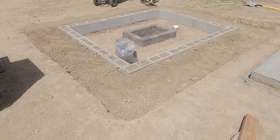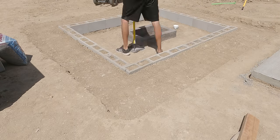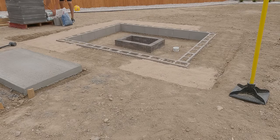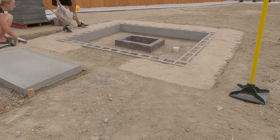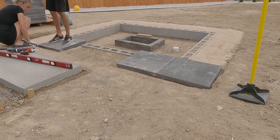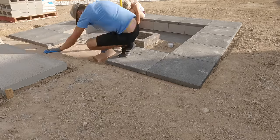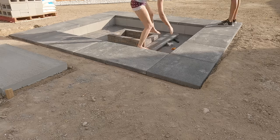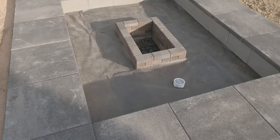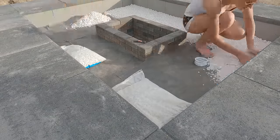I've been tamping it down quite often and now I'm ready to start adding some sand. This is all-purpose sand — the same stuff I used for my patio — really nice and helpful for laying down pavers and making them level. Once everything was nice and level it was time to lay the pavers. Everything laid down very nicely with a tight fit. We also laid down a weed barrier for the floor, then laid down white marble pebble for the flooring, which matches the design of our patio.